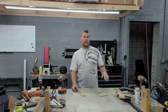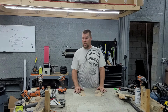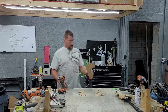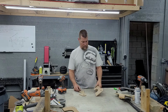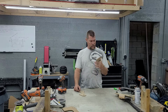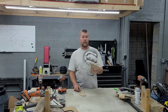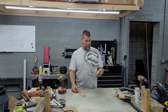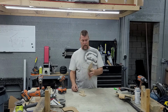So our next step is our axle mounts for the link arms. I did go ahead and make some cardboard templates. I started with this guy right here. Whipped that up out of some cardboard. Then I had some 1/4 inch thick, I don't know, what is this, masonite press board? Something like that. Because it's always easier to whip something up out of wood or cardboard if you can, before you go chopping it out of steel, obviously. But this is going to be my starting point right here.